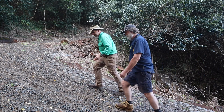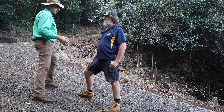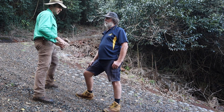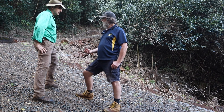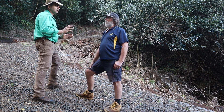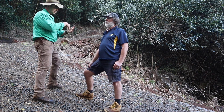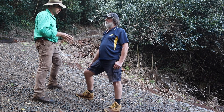Dave, you're not just using the concrete mats in your orchard — you're also using them on your tracks and driveways around the farm. That's right. And this is a fairly steep example. You've had this in place for over 12 months now. Have you experienced any erosion on what would be the steeper side of a farm track? No. You can see that all the blue metal is holding in place, which comes back to having a better base with clay in it rather than just straight blue metal. It's really important for people to understand that if they're using this and throwing metal over the top, they've got to use road base, not crushed rock. Blue metal just comes out when it hasn't got anything binding it. So you need the road base with the clay in it to bind it together. As long as you do that and you get your road right, it's going to hold.